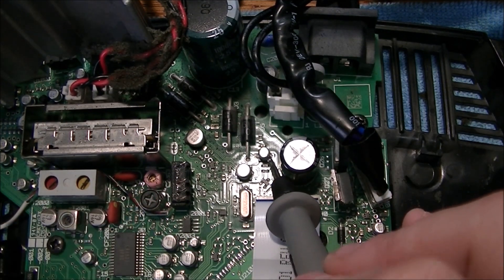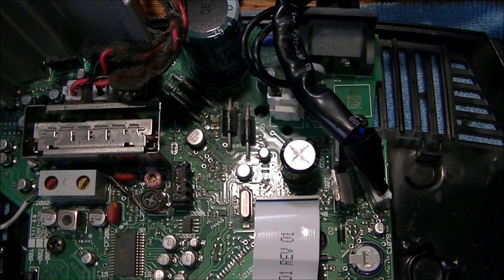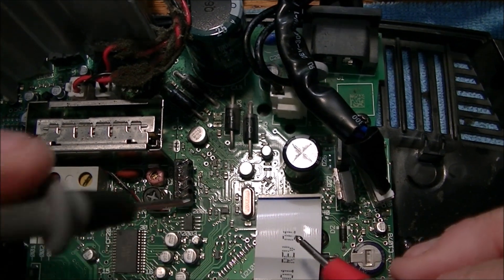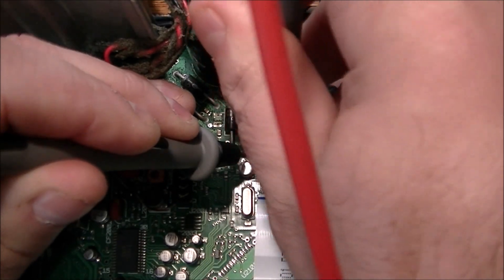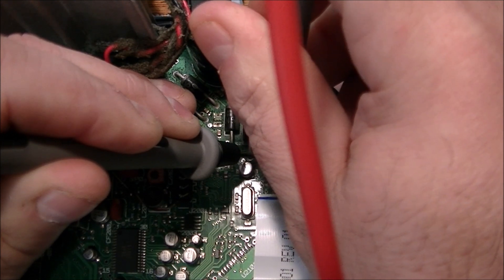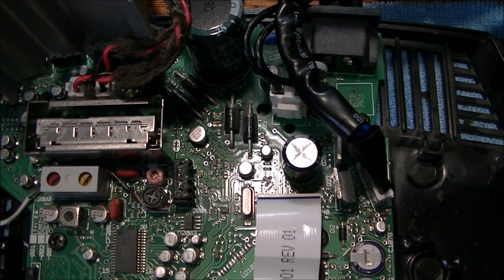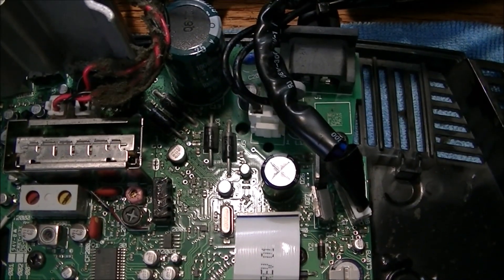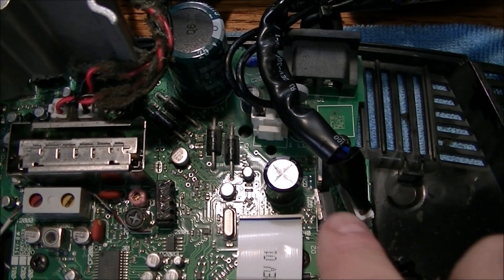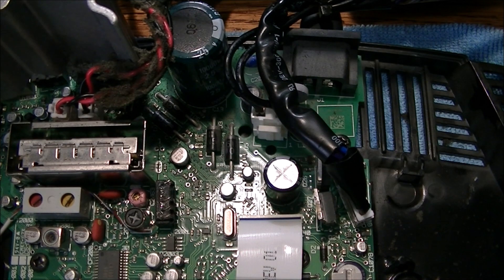Back here is another capacitor, and you can see it's marked negative on this side. Switching back to capacitance to check it - touching ground - and it says overload on the meter. That is a 1uF 50V capacitor and I do have a 1uF 50V. I'm thinking this is where the event happened - the electronic melting of wires. I've got to take the chance and change that capacitor to see if it brings the radio back to life.